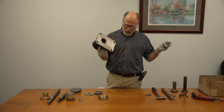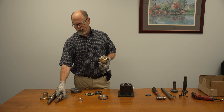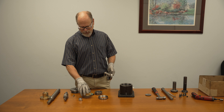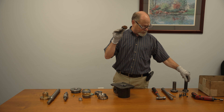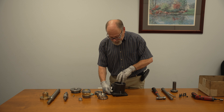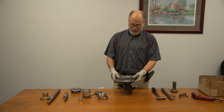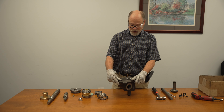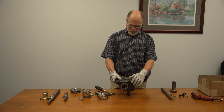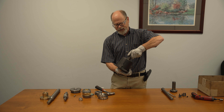So of course you've got all your parts: your shell, bearings, your gear and your worm. We already pressed the bearings on, so you just need a hand press to press those on. We've got an expansion plug — normally you use a plug to keep trash out, or a small pipe. You can use a fixture, a pipe, or a piece of wood — just to plug the hole up. Put the plug in. Normally we put a little bit of silicone or RTV just to seal it up real good.